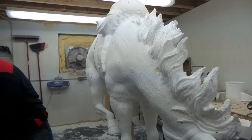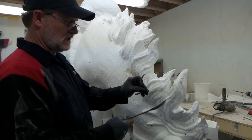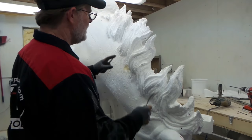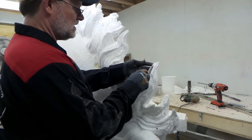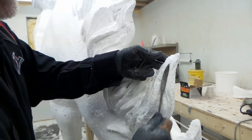Once we have the die grinder detail in there, we come back with a series of files. You can get these at hardware stores, though they're a little hard to find — we found them from an importer and buy a whole bunch, then remodel them to make our own tools. All you have to do is go in and it'll refine those edges, and you can use the edges of these to make different hair patterns in the detail.